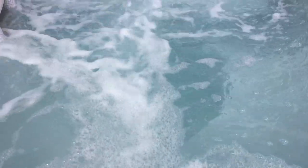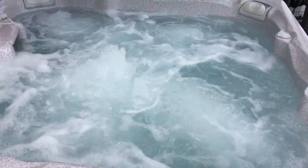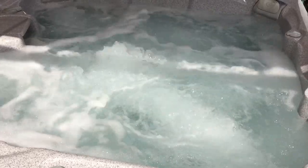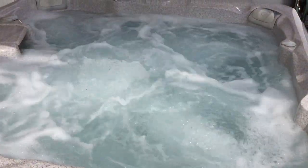We're back up and fully operational — I hope this video helped. If you have a newer model hot tub with a circuit board and it stops heating, don't just assume that it's the heater. It could be the heater relay board as well, or a few other things. Until next time — happy hot tubbing!